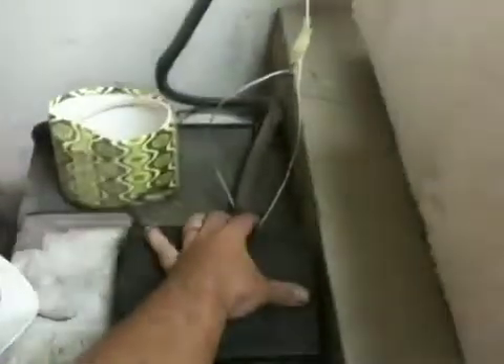Got the control box here. Like my electric etcher in my other video, I just used a larger Radio Shack project box. I got a little temperature controller off the internet, some power lights, toggle switches. There's the 220 — it's actually a dryer cord I used to power this thing, since this is a 220-volt element.